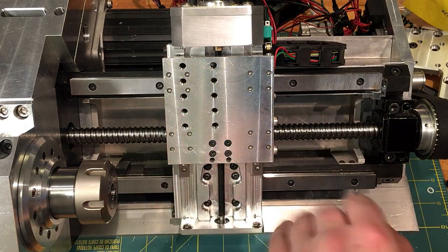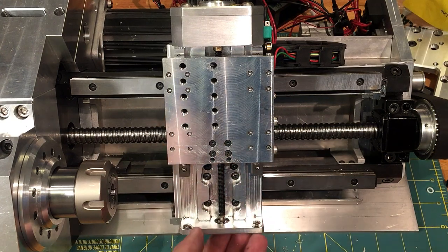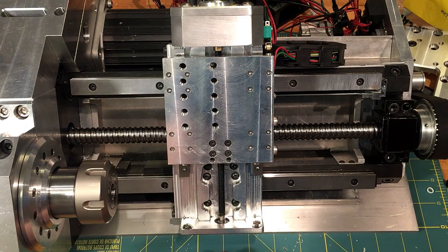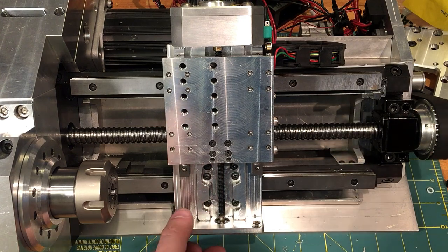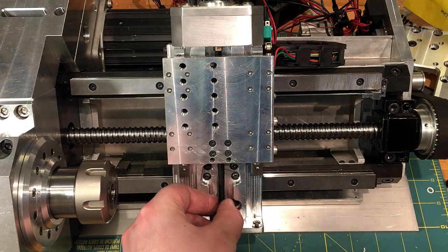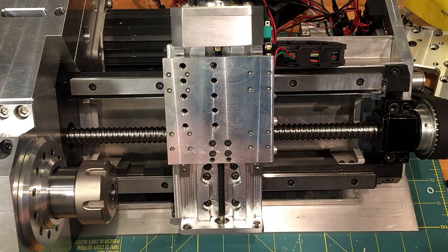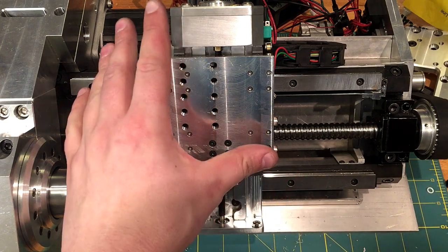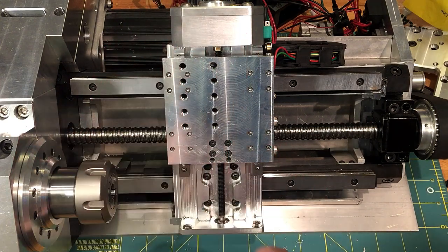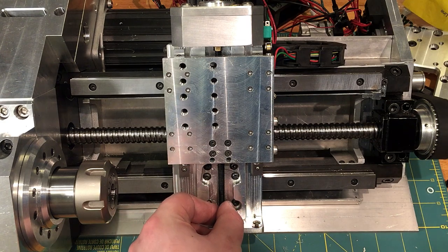There we go. Alright. You can see the lead screw and the end bearing and all that. This end bearing doesn't really do anything — it basically just prevents it from whipping. It doesn't take any load. Whipping is basically when you have a screw that's too long and too thin. If you run it fast enough, it'll start whipping around and you can hear slapping noises. It basically destroys all the bearings and components, sounds awful, and wears the screw out really fast. So it should be avoided.